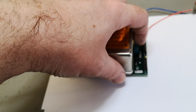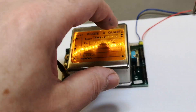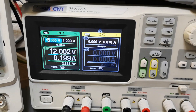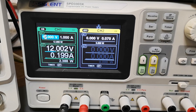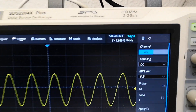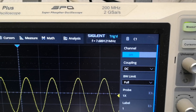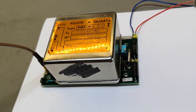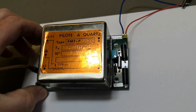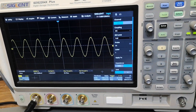The unit feels really, really warm — that is not normal for an oven oscillator. It should feel cold on the outside; it should be super insulated in its internal design. Ten minutes since power-on and power is about 2.4 watts and 0.2 amps. A scope is not a frequency counter, of course, and this oscillator is 10 to 100 times better in frequency stability and accuracy compared to modern SMD oscillators.